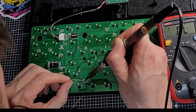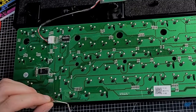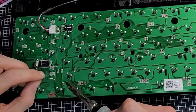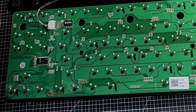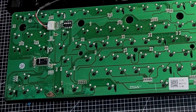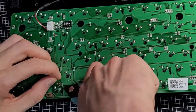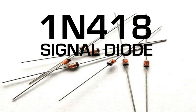After testing for which ones were dead, I very carefully desoldered them, trying not to hurt the pads underneath because they were probably also weakened — using just a little bit of violence when necessary. Cleaned everything up and got ready to put new diodes in. Unfortunately, all I had on hand were through-hole 1N4148 signal diodes, but with a bit of cellotape, you know, made a plan.